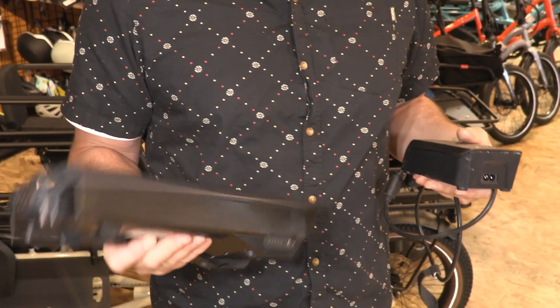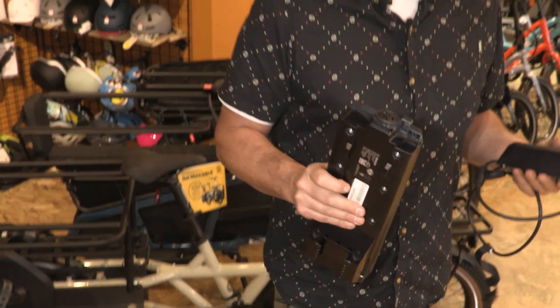The next thing is the 80-20 rule. Ideally the battery can always stay between 80% full and 20% full. No problem if you charge it up to 100%, but do try to take some of the energy back out of the pack sooner rather than later. And if you're storing for an extended period of time — like a few months — try to store these things at about half full. That's where they'll be the happiest.